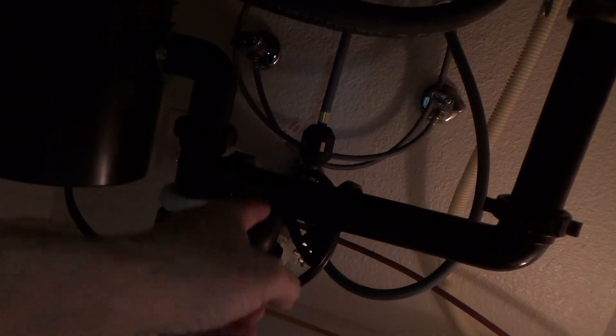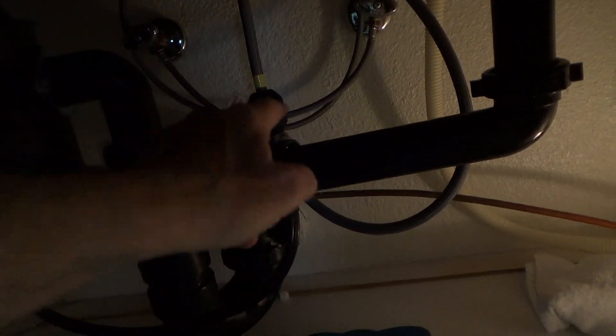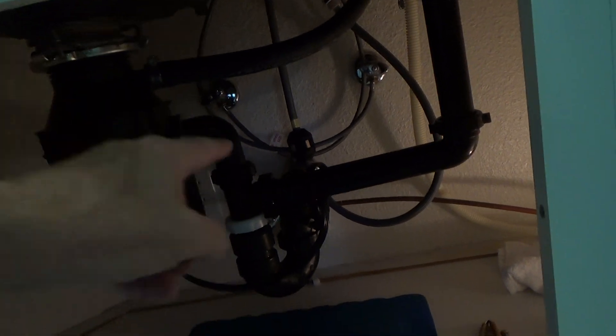It's situated right - it's not hitting the hot or cold water lines in the back. This pipe is allowed to flow easily up and down. See here, it's not hitting anything - not hitting the garbage disposal pipe, not hitting the drain pipe, not the hot or cold water line, not the wire for the garbage disposal. Had I put that lower down, every time you pull this up you'd hear it hit and sometimes it might stick. If you have an old sink faucet that's hitting, maybe you can redirect it - loosen it and reposition it up high rather than down low.